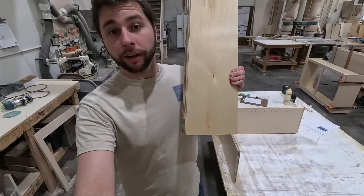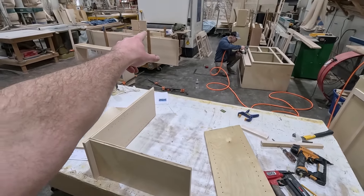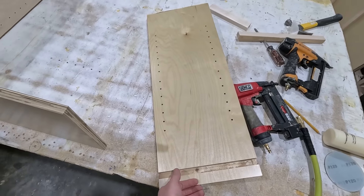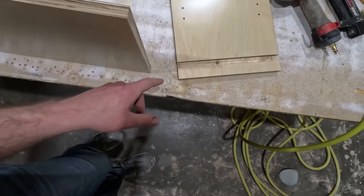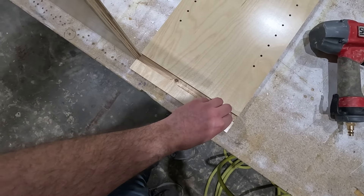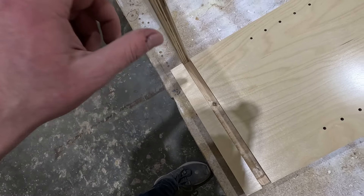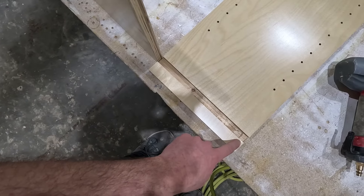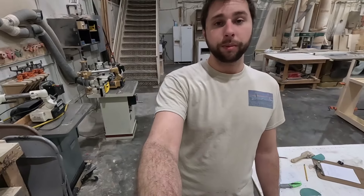We account to be right on the money, but sometimes that doesn't go to plan and we need to cut down the cabinet to fit the area. At this point we have all our pieces from the cart, so we're going to start assembling. We have a dado in our board that's going to seat right in with this end of the board. We'll throw some glue in here and put staples on this side and pins on the finished side, because pins leave a smaller hole to fill.